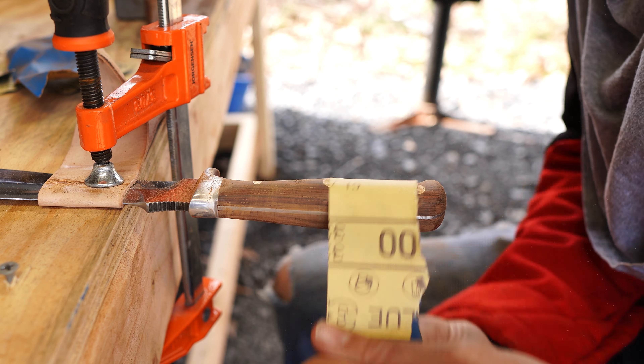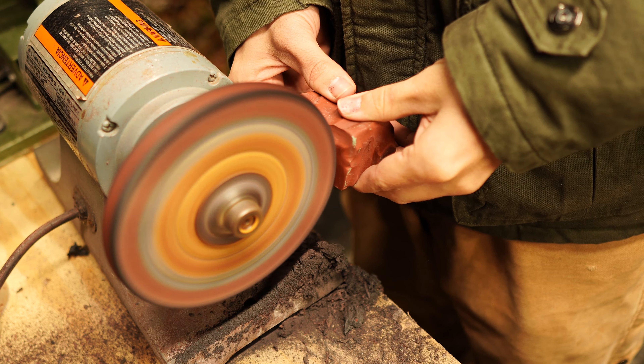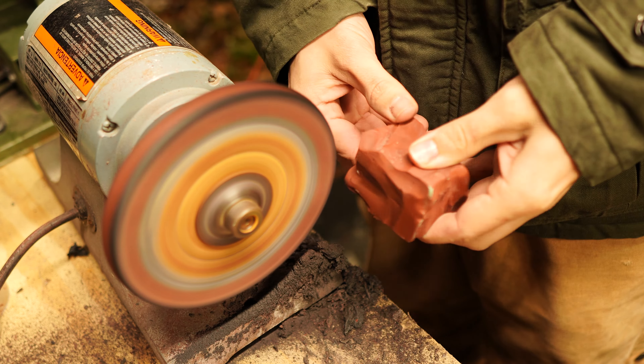At this point we're almost ready for the final polish, but first we've got to get this edge nice and sharp. The blade has already been mostly sharpened by the buffing and polishing processes, so all we really need to do is apply some sharpening compound to the wheel and make more focused, controlled passes over the edge to really fine-tune it and hone it to the razor sharp edge we're looking for. Obviously there is a lot more that goes into sharpening a knife, but I actually made a whole separate video about sharpening knives if you need to know more. For now we're keeping it simple and just smoothly honing the edge until it's razor sharp and consistent.